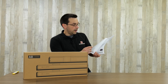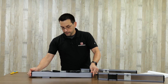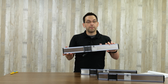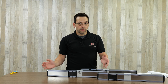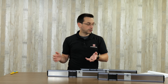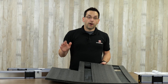In the assembly instructions there's a little blue circle with white lettering indicating box location - A8 is the second layer of boxes inside the main case. Two of the modules have a Y label on the cable connector - these are the Y-axis linear modules. They're noticeably beefier than a 2020 rail because this machine needs strength for CNC cutting as well as 3D printing.